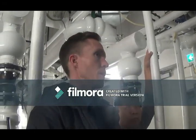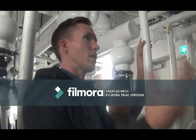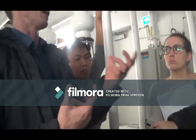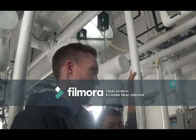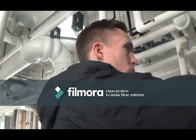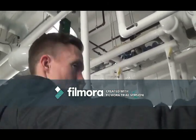The gentleman over there, John Skittles, made a good point. A lot of the time when boilers go down, it's not because something has failed within the boiler, but because a safety is open, because something in the system isn't working to the standards of the boiler. About 75% of the time that's what's going on. Any message that shows up, we'll throw up on this history bar here. We'll take a look at that in a second.